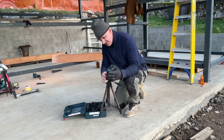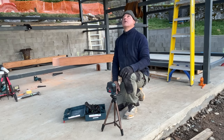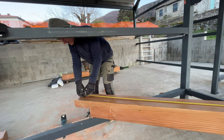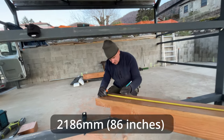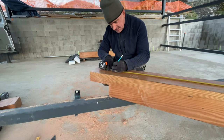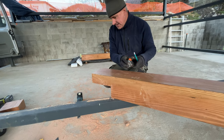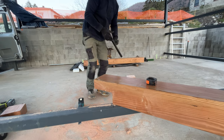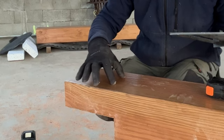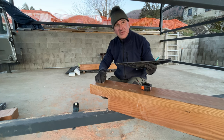I'm using my laser level again to find the plumb using the bottom to the top. Right on it — that was a pretty good guess. I'm just going to mark off here. My base is 100 exactly, so that's going to be 2186. So that is where my bracket has got to sit. It's such a shame I couldn't just slide this on, but I'm going to have to cut this section out here for the bracket, and then put this little piece back in.